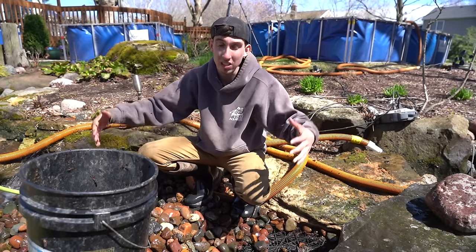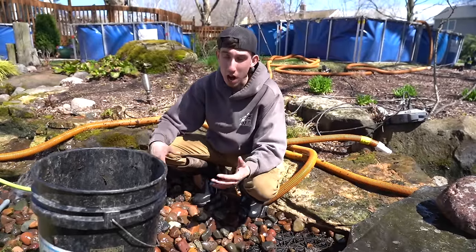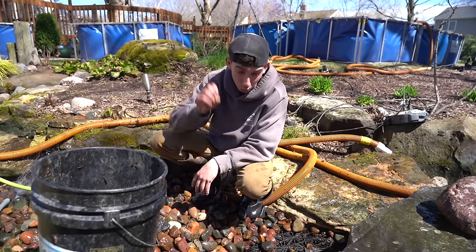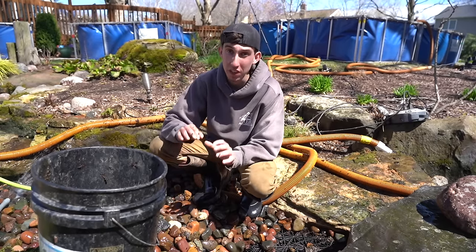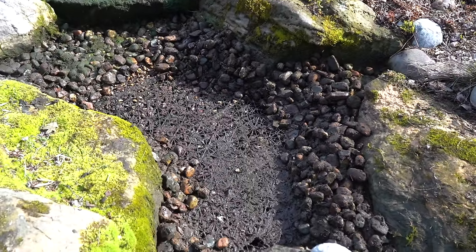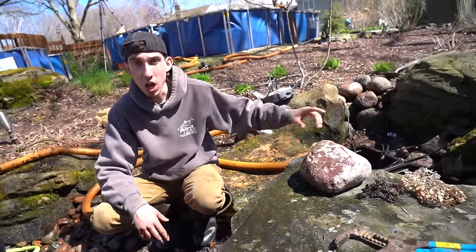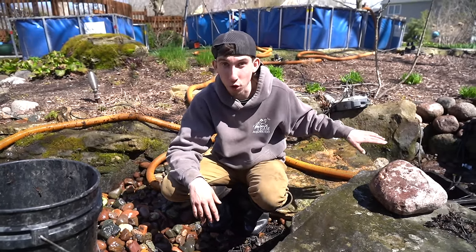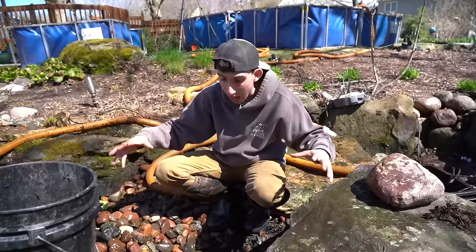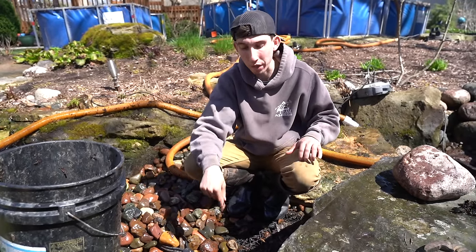This area is a big 3,000-gallon basin. The waterfall jumps down on top of it, water travels across the gravel, then dumps down into these aqua blocks. This functions as the skimmer for our bigger ponds — it skims all the debris off the pond and deposits it in this area. The upkeep on these is very crucial because if they get clogged, it can cause a leak by driving water up high. It was actually causing a leak here — there's an overflow in that corner, and the water line got so high it was hitting the overflow and going into the drainage system. We pulled all this gravel away, power washed the gravel and aqua blocks, and now we're picking all the debris, getting it into buckets and out of here — we do not want this getting down into the aqua blocks.